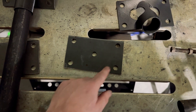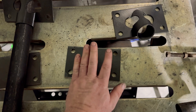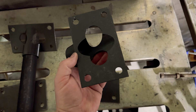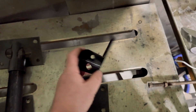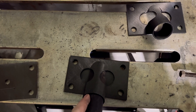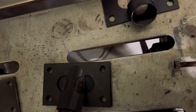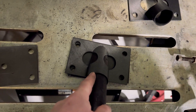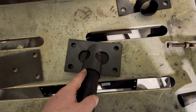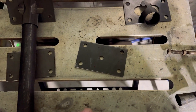Next, clean off the mill scale on both your pipes. Use a flap disc or whatever you prefer and make sure these are bright shiny metal around there and around the end of your pipe. Once you've done that, you can slide the pipe with the cut into the template. This template lines everything up and is the most important one for making sure your engine stand is square. Line it up with the four holes, then use the holes either side to make your two tacks, and that will hold everything completely square.